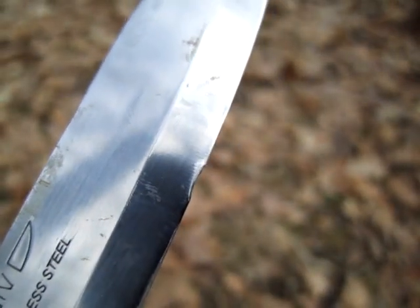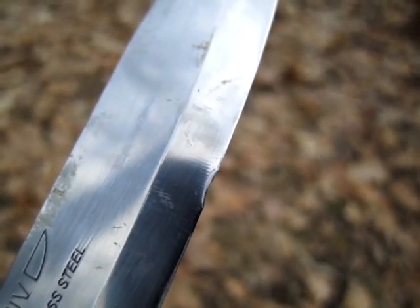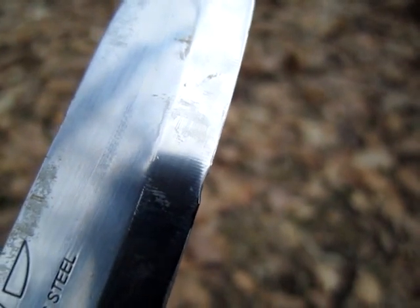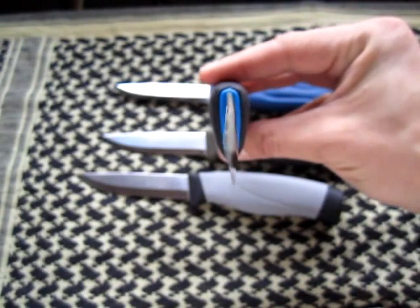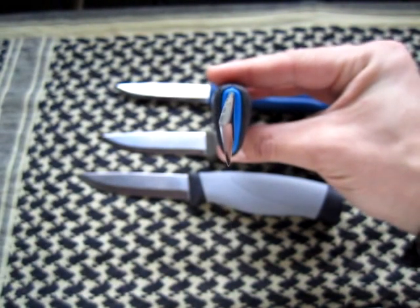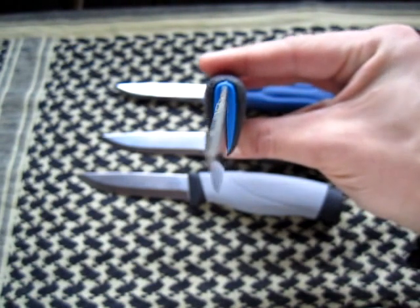And as for the bend in the blade, the roll, that one could have been prevented if I would have done what I do with basically all my two bevel edges, Scandi edges. Before I take them out in the woods, I clean up the entire edge on my waterstone and I put a secondary micro bevel on it. Makes them more resistant to exactly such things. You can probably see it. There is a bend in the blade. That I do not like.